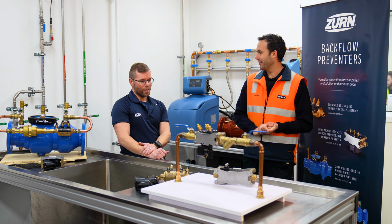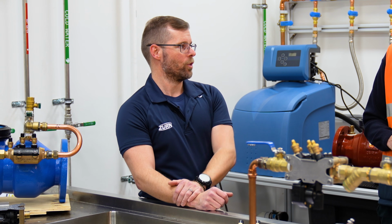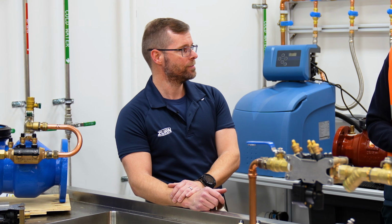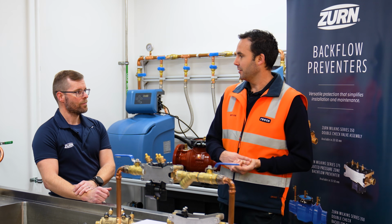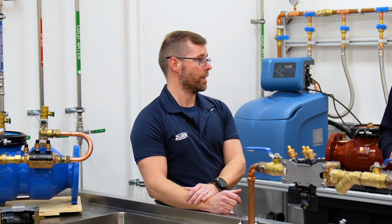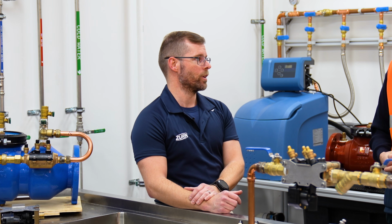What actually is backflow? Yeah, backflow is super important to us. It's any time we're talking about the unwanted reverse flow of water. So generally from a building or a site back into the drinking water supply. So Lawrence, how important is it to stop or prevent backflow? Backflow prevention is crucially important. We don't know what contaminants could be getting into the water. We want to make sure we're reducing and preventing that risk of contaminating drinking water supply.